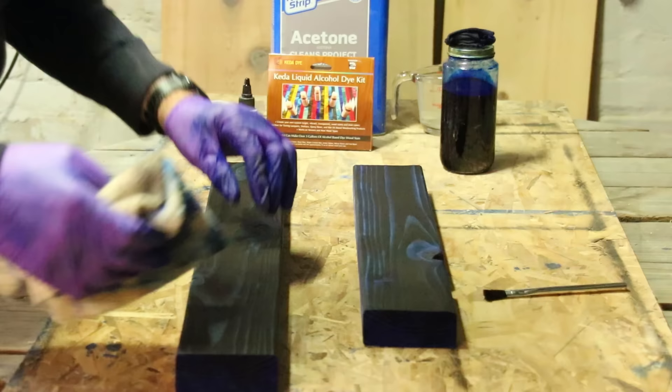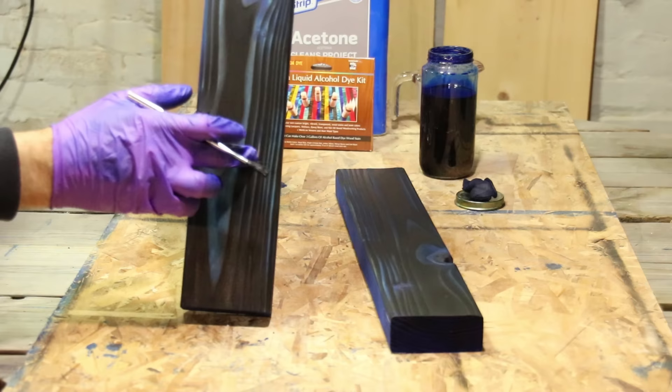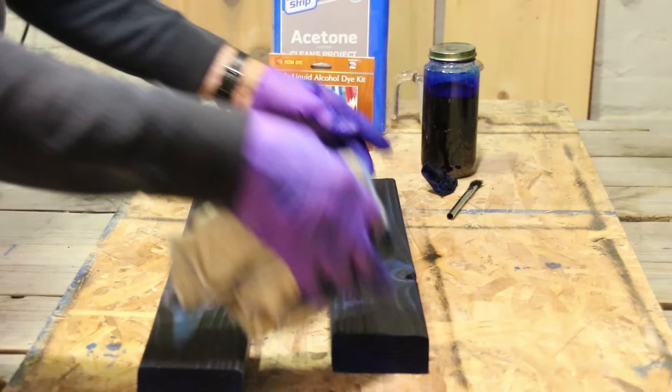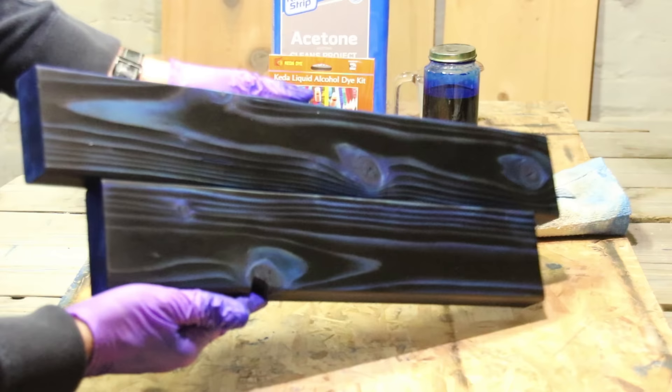So I ended up taking the acetone — for some reason I thought I used rubbing alcohol, but I did take the acetone — and wiped it back. I just wiped some of the surface dye off with the acetone. If you're working with softwood like Douglas fir or pine, you want to watch out because sometimes you can get little splinters. I just had a little tear out right there just from wiping it down. So I just took the soldering brush, blended it in, color-filled that area, blended it with the cotton cloth, and wiped it down with the acetone again to blend it all in. That's what it looks like with just the dye stain on there.